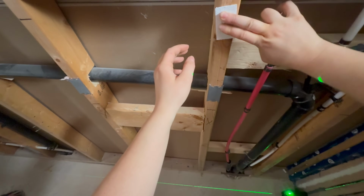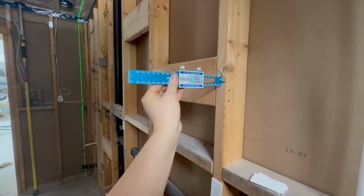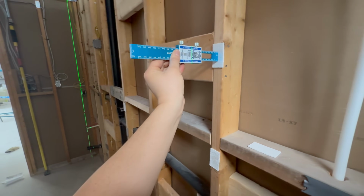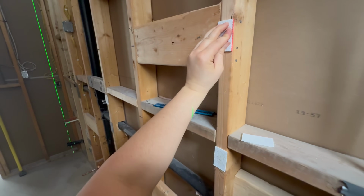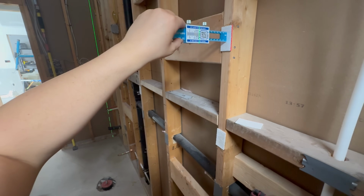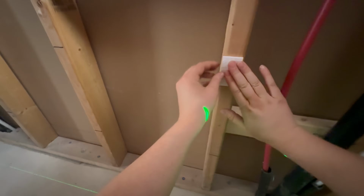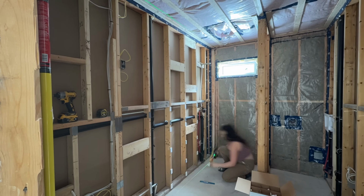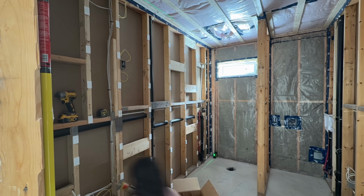So from what I could find, this foam shim kit seems to be a one-of-a-kind thing. But I've also seen tilers online wet shim their studs, where they put a compound on and then put their sheet of drywall up. And then you use a level, kind of squish it and push it in the right direction to become plumb and straight. So I'm curious, have you done that method before? And do you think shimming the walls before tiling is even worth it?